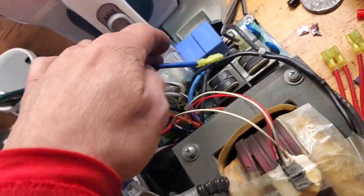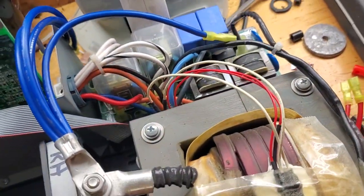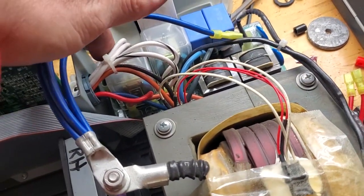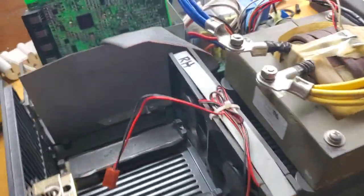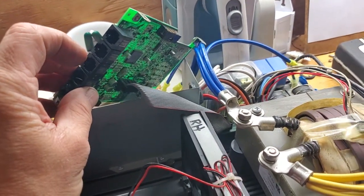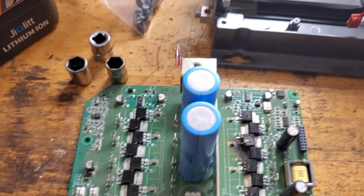That's your pass-through relay, and that's your ground coupling relay, because when you're hooked to a 120-volt source you need your ground and neutral bonding. That's your pass-through. And of course you've got your different cables - you've got your stack cable, your communication cable, your battery temperature sensor, a couple of different things.